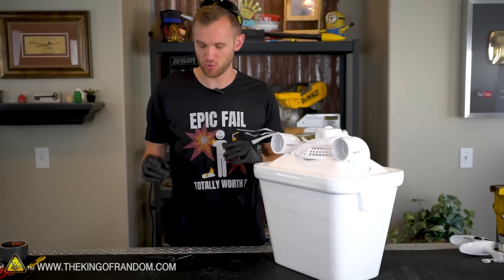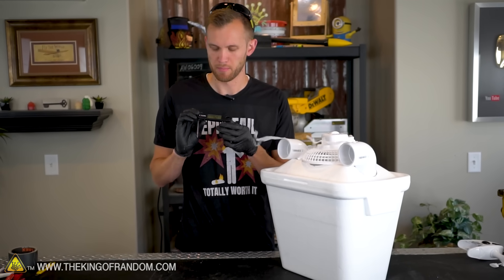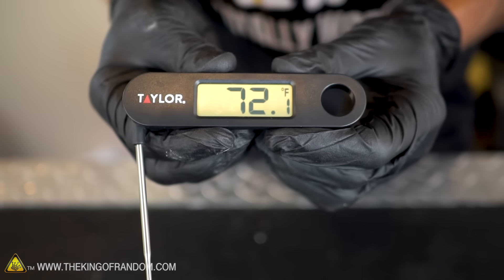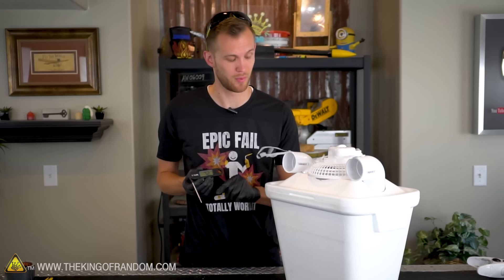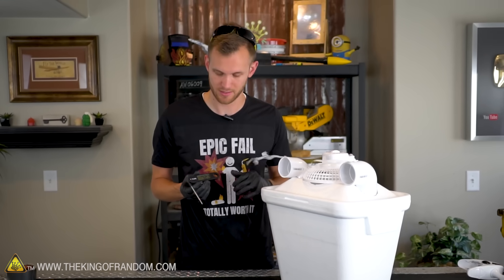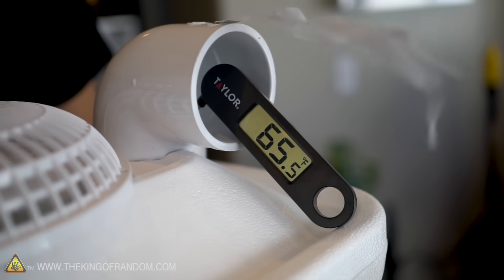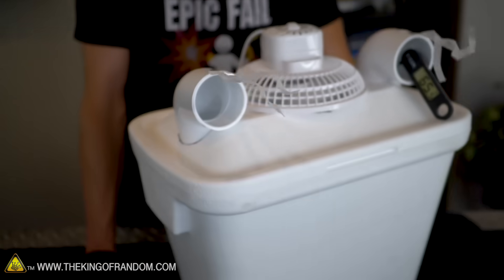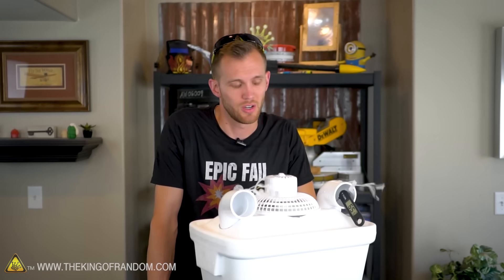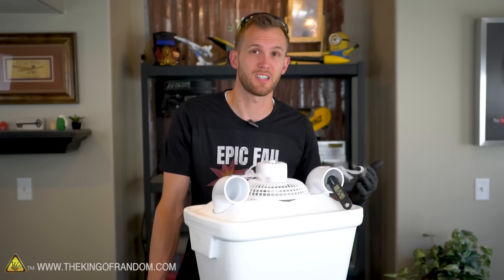Just to make sure, I've got some actual measurements. I have a thermometer — a food thermometer — that says it's about 72.1 degrees in this room. Let's see what happens if I place the temperature probe in front of the air coming out of our cooled box. It seems to have stabilized at about 65 degrees — that's about seven or eight degrees cooler than the ambient temperature.